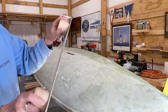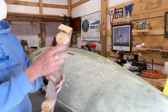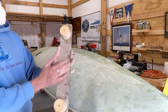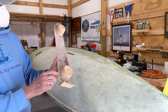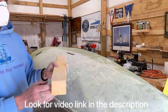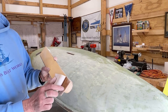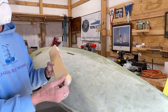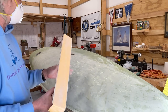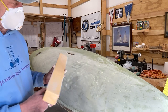I'm using a flexible sander that I made. I just made these handles with pieces of pine — just regular lumber — and I used a hole saw, cut them out, sanded them off. Very thin piece of plywood here, I actually think that's cedar. I made this a long time ago. This is 150-grit body work paper, it's sticky and sticks on the bottom. I do have a real thin piece of cork on here that gives it a little bit of cushion, and man, that just takes it down in a hurry. So we've got 150 grit, and then we're going to go to 220, and that's knocking it down in a hurry — it's just getting real smooth. We're going to be ready to fiberglass in no time.